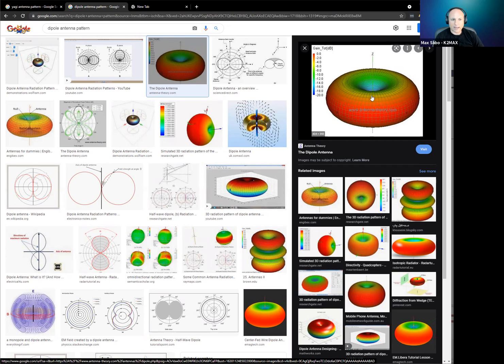And this is looking at the antenna as the Z-axis here, I guess what they labeled Z, but you could consider it Y. And so there is a deep null in the center of it. But in general, it's just kind of like a donut expanding through space. It will radiate equally in all directions. And that's why a vertical dipole like this is really considered an omnidirectional antenna.